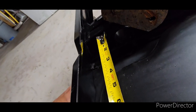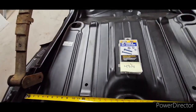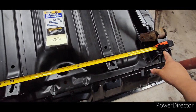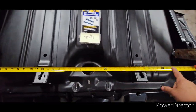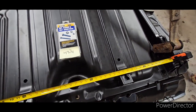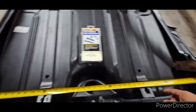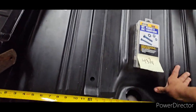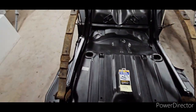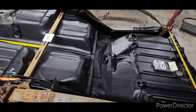As you push it in, look at how they fit on the frame rail — nice and flush. That's the method I use. And once I have this measurement — that 43 and a quarter — and the frame rails are nice and tight with the ratchet strap, I put self-tappers in so she won't move. Then I come over here and set my original leaf springs with the shackles.